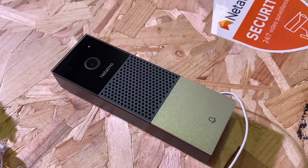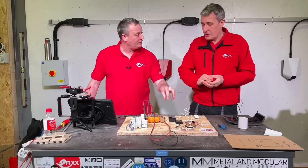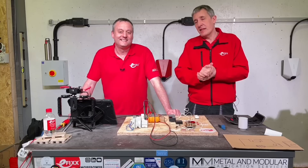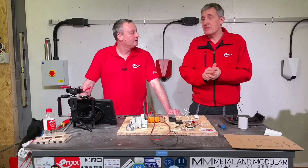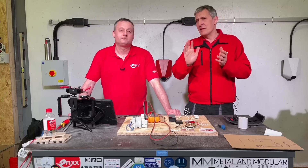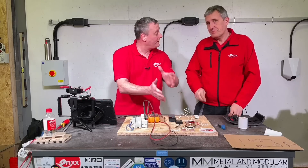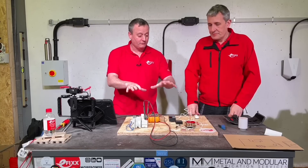We didn't change any of the wiring when we were in that smart home takeover — we used exactly the same wire that was there, but we managed to charge the battery inside the smart doorbell. Yeah, the battery's there obviously to keep the camera alive at night; you might have some infrared LEDs on there, and at certain times the camera may take more power than the transformer itself could provide, so it's got its own power reserve. And then it also has to function like the old bell switch — it activates the bell chime we've already got in the installation. So not a lot of work to do electrically, but there's some really clever stuff in there, hence the rig you built.